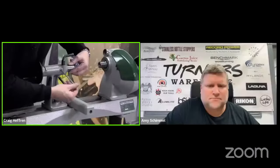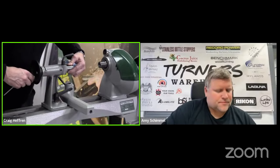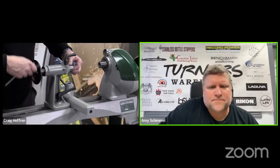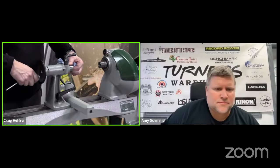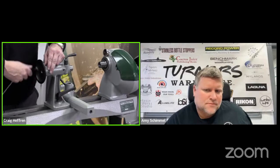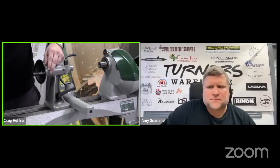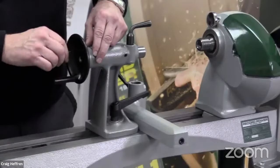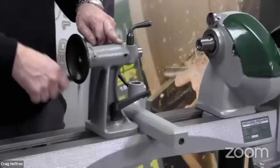And then you'll feel that bottom out, and then just come back a quarter turn. And then you should be able to slide it without feeling any burr. Then we can go back in with the hand wheel. As you go in, drop the keeper plate back in. And again, as you drop that in, just make sure you feel it and you don't feel any burrs as you rotate it, before we then lock off with the smaller Allen key. Again, don't over-tighten that. Just make sure it nips the keyway in place. And then you're going to have a nice, smooth tailstock when you're going along.